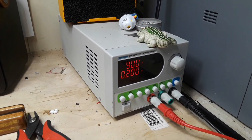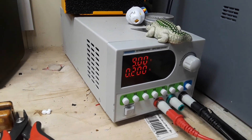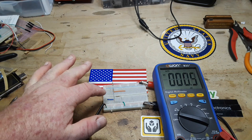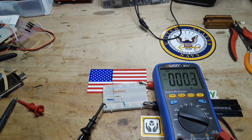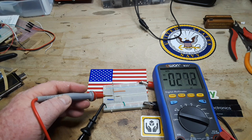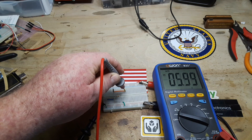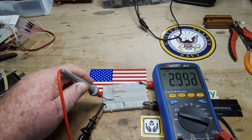Just to keep the math easy, because we're dealing with three resistors, I've put the input voltage down to nine volts. Okay, everything is attached. We have three resistors in series going from V-in to ground, and at the junctions we've broken out points where we can measure voltage. According to our formula we should see two-thirds voltage at the first junction — about six volts — and one-third voltage at the second — about three volts. 5.99... and about three volts. Easy.